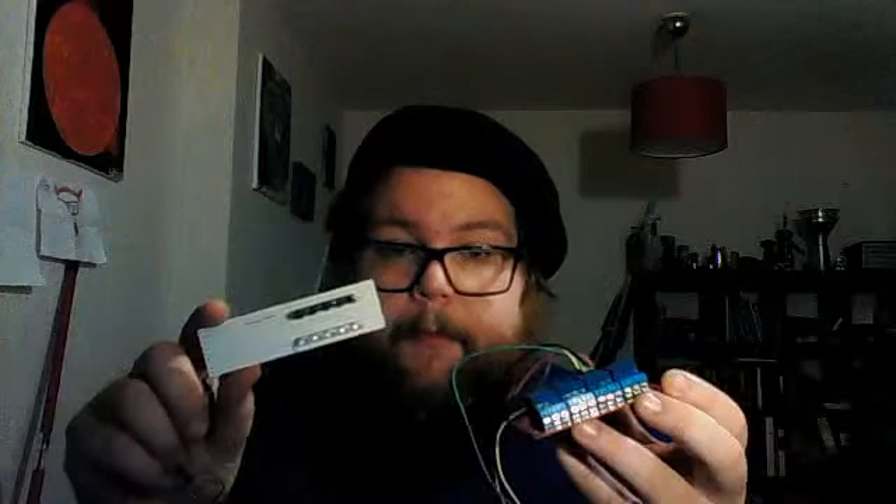And also a passive IR detector connected to the Raspberry Pi. This senses motion, which sends a signal to the Raspberry Pi to turn on the camera and to switch channel 1 on. So the IR LEDs will turn on and the camera will record the file to the USB memory.